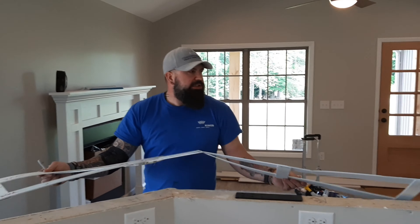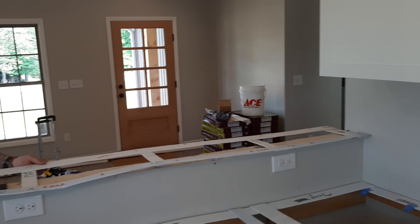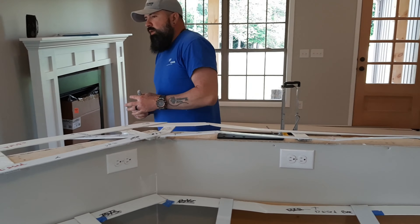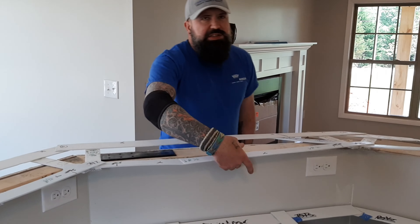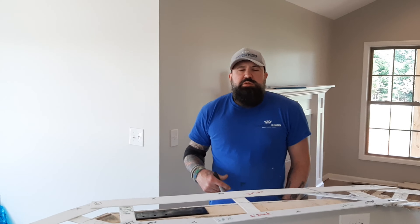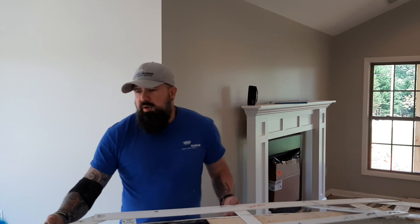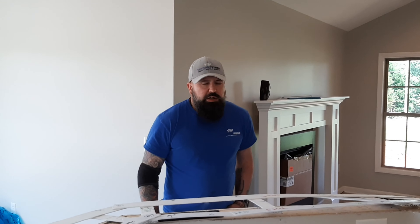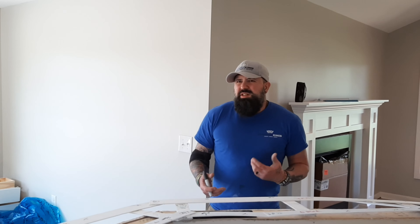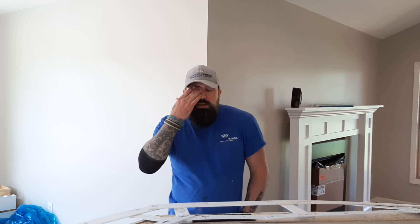This is our template here. Now the customer has changed her mind — she's changed from wanting tile to wanting a riser backsplash. If she was going to go with tile, we would do a standard overhang of say an inch and a half. Now that she wants to go with a granite riser, we're going to have to extend that overhang. Normally with a riser I'd go with about two and a quarter, but where she's got such a small amount of overhang in the back, I'm going to go a little shorter — probably an inch and three quarters. That'll still leave us about a half inch sticking over to hide the upper section.